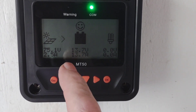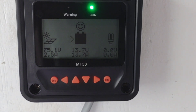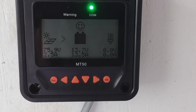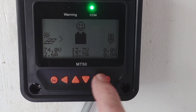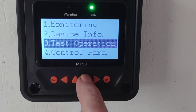I'm going to show you what that looks like and what's working well for me. Right now it's a little cloudy — got 13.7 amps coming in off this top string of five 100-watt panels, and the second string is doing roughly the same.